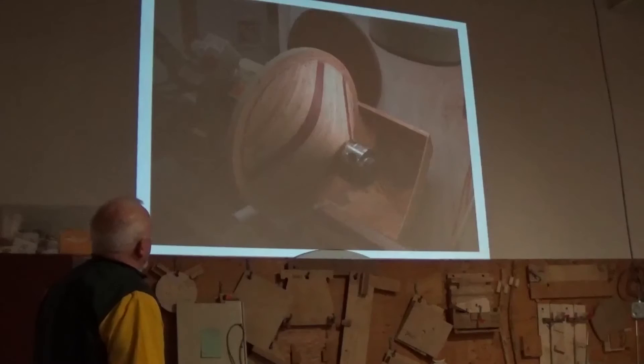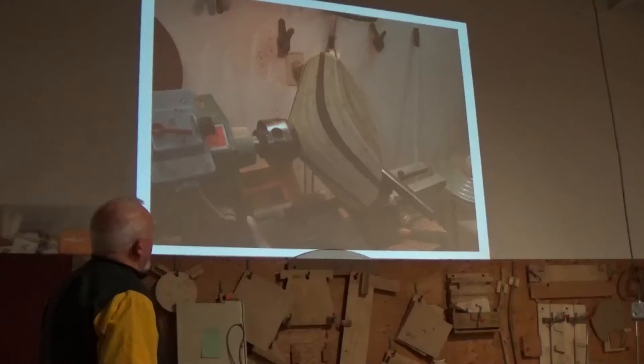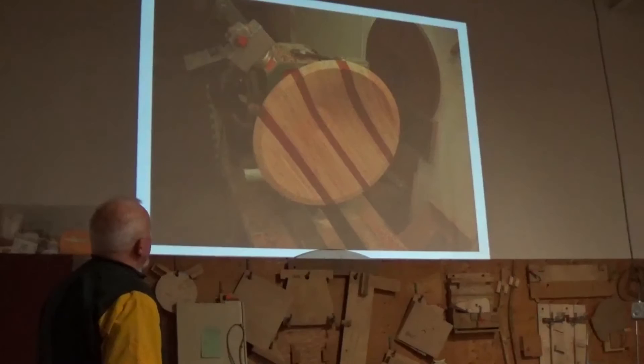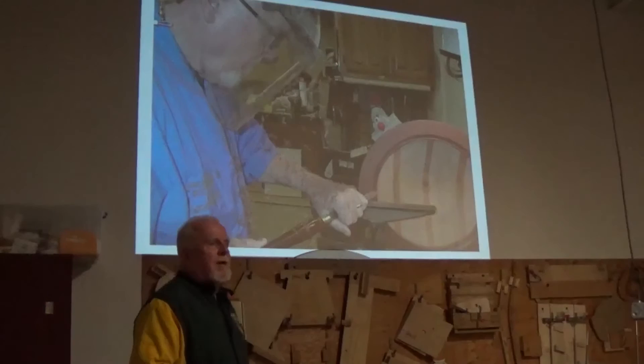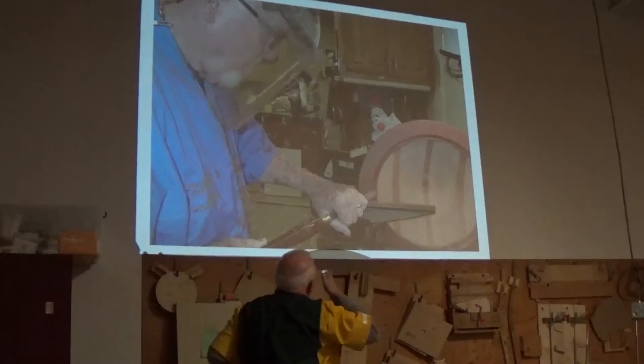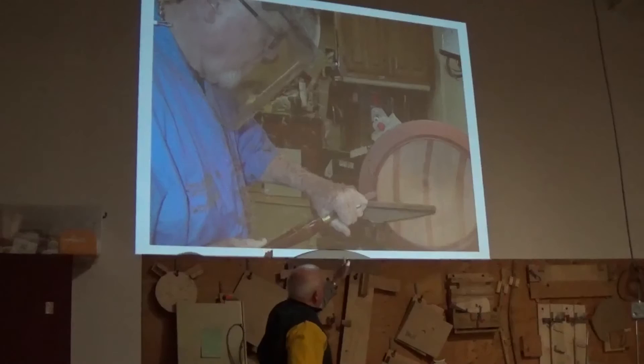There they are, already cut out, with a better job of lining them up. Getting ready to be turned. I had a flat spot so I put carpet tape on a flat piece of material from Home Depot with plastic on it — I knew it was flat — put double-sided carpet tape on it, stuck all the pieces down, and ran them through my drum sander. There's the bowl with the outside turned and the chuck in the recess in the foot. Turning it around now, getting ready to turn the inside and put a rim on. That's the inside turned and the rim flattened in preparation for a rim. When I'm facing off the edge of the rim I come at it from one direction not the other — it's much easier to turn, and I do the same on an angle trimming it down to the shape of the bowl.